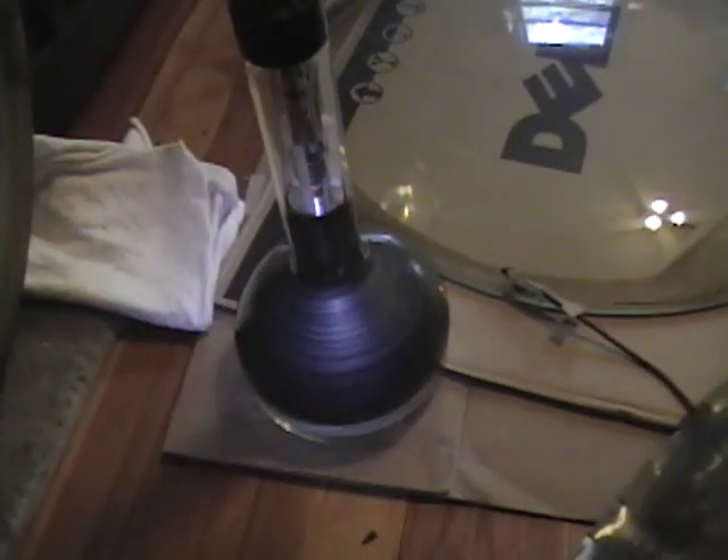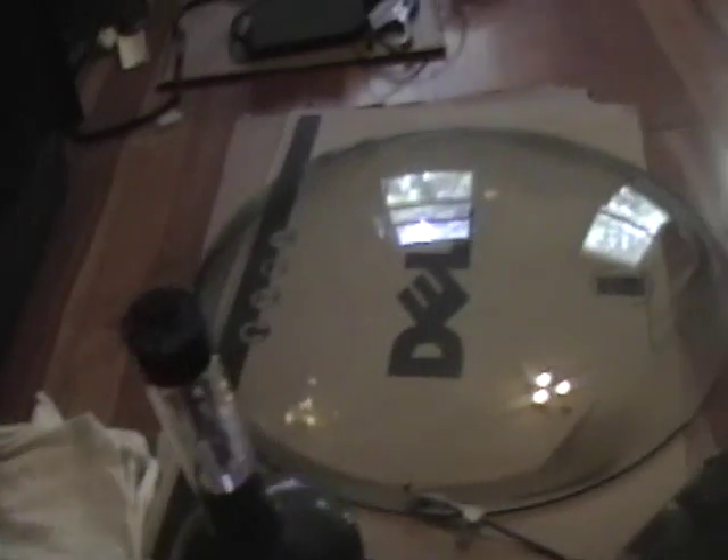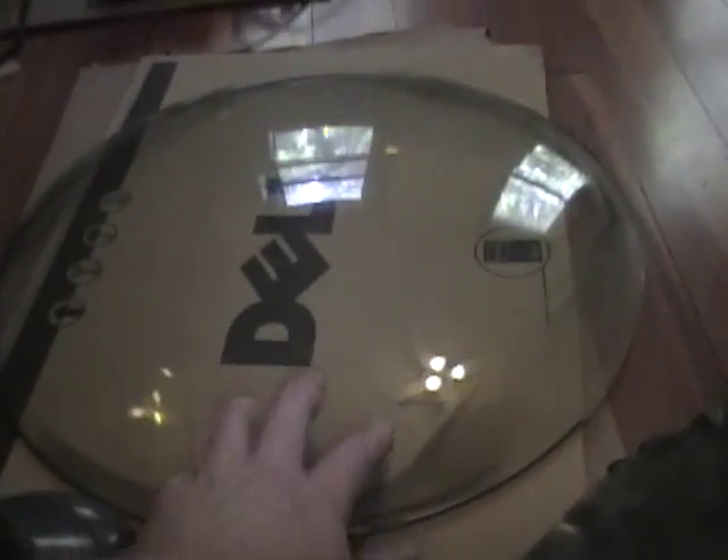Another problem is if this were to crack and implode — an all-glass CRT is bad enough, it'll implode and little bits of glass will go flying around. But with this, if it was to break, it'll implode, bits of glass will go flying backwards toward the center of the tube, hit this metal, and come flying back out the front almost like a little shrapnel cannon.